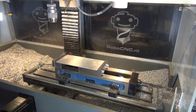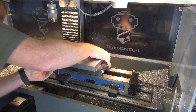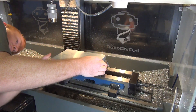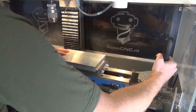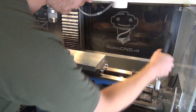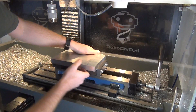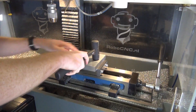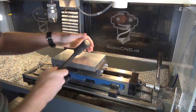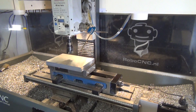I first laid down a piece of scrap aluminum sheet to raise the material just slightly. I do have to drill some through holes — the gantry side is going to be 20 millimeters thick but this material is 25 millimeters thick. So the through holes will become true through holes when I machine the other side. The plate is there to get some more clearance above the vise.